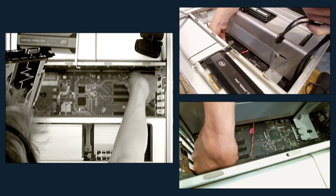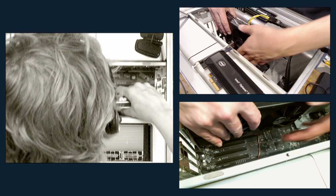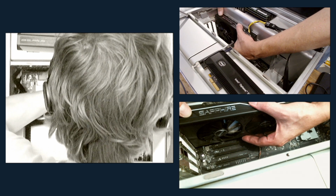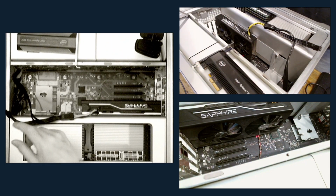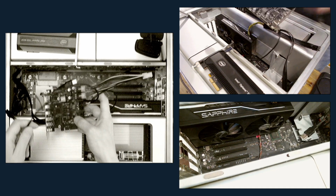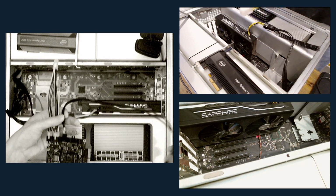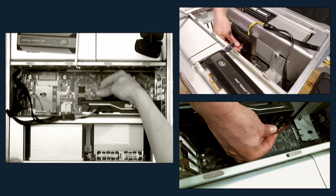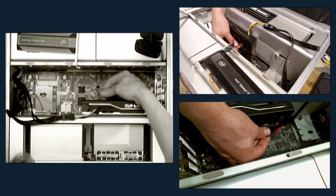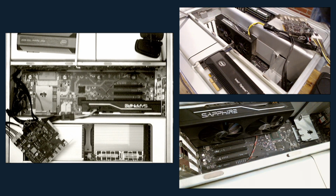I did go ahead and connect the USB into that Bluetooth module, because I'm not using the module, and I need the USB port internally to connect to this Thunderbolt card. Prior to this point, I've been using USB headers run outside the machine, plugged in the back, but now I've got an internal connection going to that USB Bluetooth module. It's worth noting that module has a 3.3 volt port, so the power doesn't do us any good there with 5 volt USB.